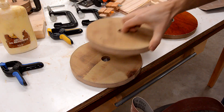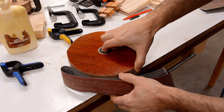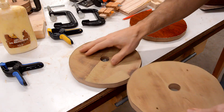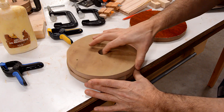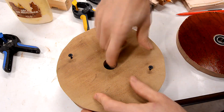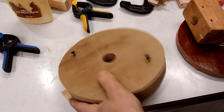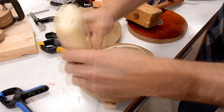Now I actually need a third layer to make the wheels thick enough for a two inch belt. As soon as I put glue in there this will want to float away on me, so I'm going to use two screws as alignment pins. Now lining up the holes on the inside, and now I can apply glue.